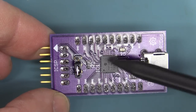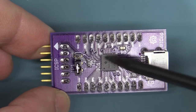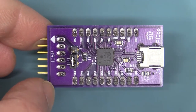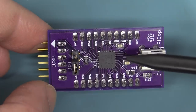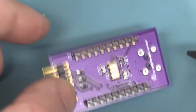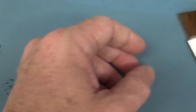He's oriented the chip correctly, it looks to be fanned out properly — otherwise you'd have a dog of a job routing the traces. There's no issues there really. It's a pain QFN package, and that's why he's supplied a little solder paste stencil with this thing. We've had a look at these before — these are from OSH Stencils, if you didn't recognize the purple board. Of course it's from OSH Park, and these are the Mylar stencils. You need some white behind there to actually see them. They do a quite a good job, and they're dirt cheap.